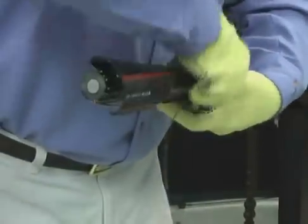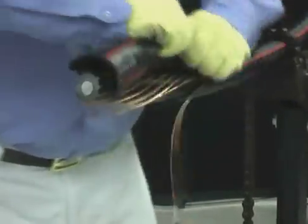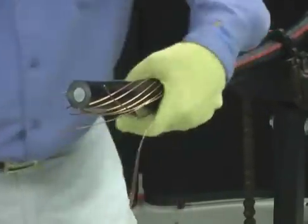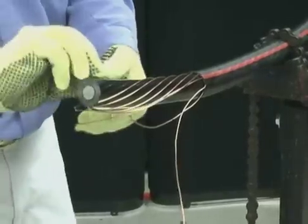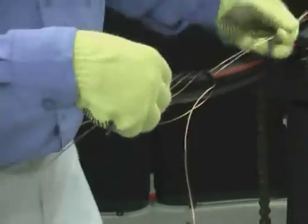Starting at the end of the cable, unwrap the jacket until you get to the square cut, then tear. Fold the neutral wires back or handle according to manufacturer's instructions.